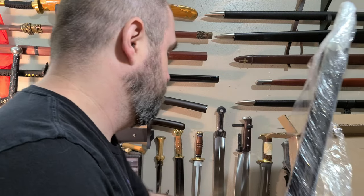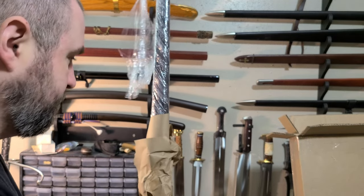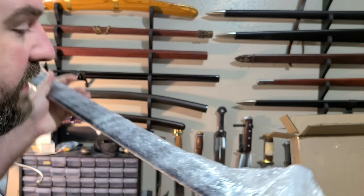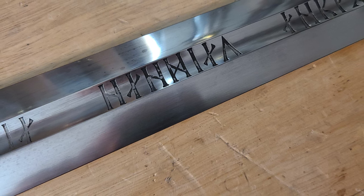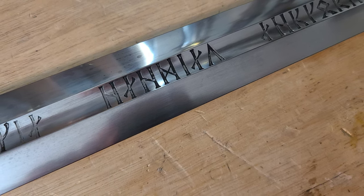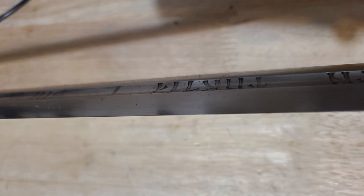I received a replacement sword in just under three weeks from the day I dropped the damaged one back at FedEx, and this one was much better — very well packaged, everything came in undamaged, and most importantly there was no rattle in this blade. I ordered mine unsharpened, but I was pleased to see that the edge geometry was already pretty good for an unsharpened sword. It wasn't sharp per se — I couldn't cut with it — but it had a decently continuous grind coming from a rounded lenticular cross-section with a fuller running nearly the full length of the blade. For grinding the initial edge I used my WorkSharp, starting with a medium-grit belt. I didn't have to reprofile anything to get a good angle, it took an edge easily, and I didn't notice any overly hard or soft spots along the blade.